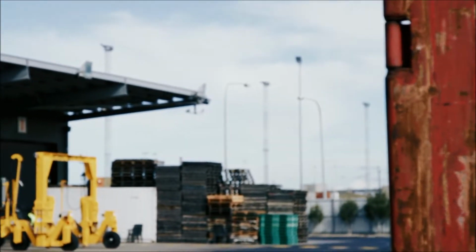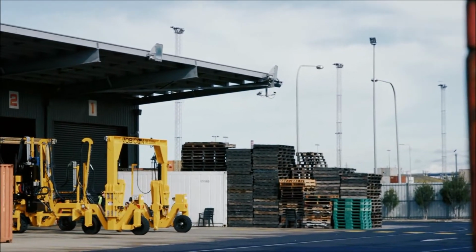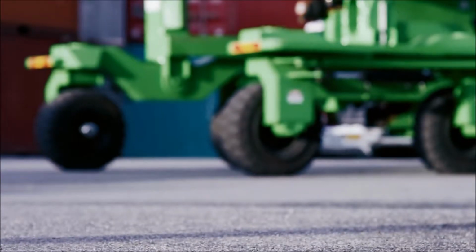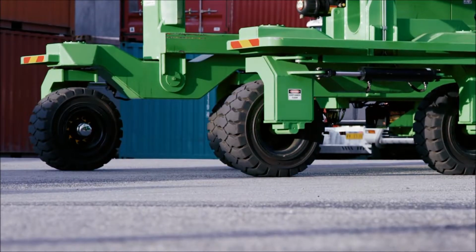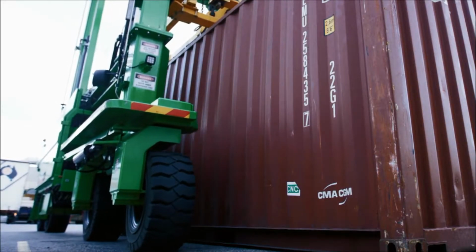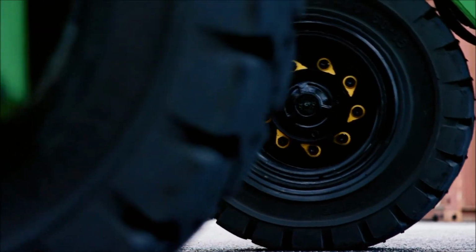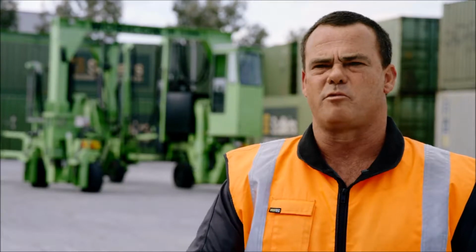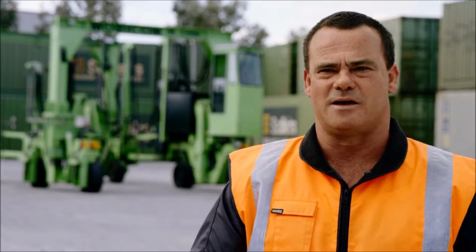The footprint on the ground of a big fork is exceptionally heavy. Our current base for road transport is 8-inch concrete, 200 mil. To go for a big fork or a heavier piece of machinery, you've got to lift it to 300 mil. The pavement we have is suitable to a Mobicon, whereas not suitable to a big fork. Your preparation for your pavement when you're building, it saves you thousands.